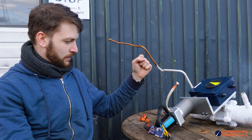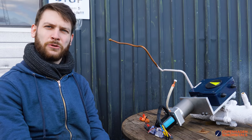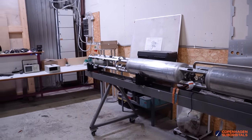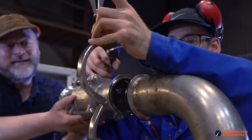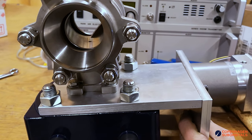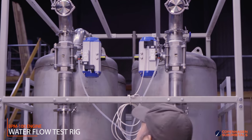I would like to thank Wittenstein, who were so kind and provided us the intermediate gearboxes for these tests — it really served a nice purpose. Now, before we go, we know some of you are asking why not use solenoid valves instead. We are actually trying out this concept on our current Nexus rocket, where the small diameter plumbing is well suited for them. But for the larger 3-inch diameter propellant lines in the Spica rocket, ball valves have a few advantages: the servo-motor controlled ball valve can adjust to any percentage opening, where solenoid valves are either open or closed. Plus, they are typically lighter, and our solution is also quite cheap and reliable.